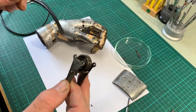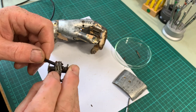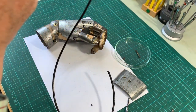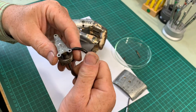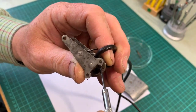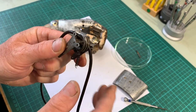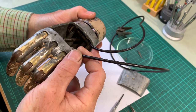Replacing the leather cord with a new one is quite straightforward. The cord is pulled through to its midpoint, allowing perhaps a metre of cord to extend either side of the worm. Once the grub screw goes in, that cord won't move again inside the worm. A single turn is taken in each direction around the worm, and the whole unit is replaced back into the hand, threading the cords through so they extend out of the hole in the centre of the wrist.